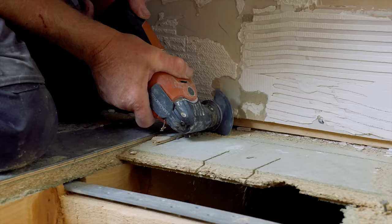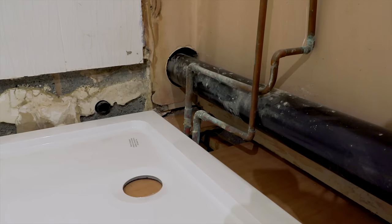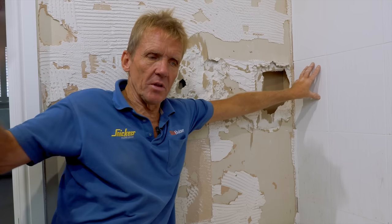I thought I had this worked out, but laying the tray down I realised it's going to be difficult to put the waste in because of the joist running through here. Also, those hot and cold pipes are running straight across exactly where the trap needs to go. So I've got to change the hot and cold supply and move the tray to miss that joist - we mustn't cut through it. It looks like I'll be hacking the tiles off the wall to get the tray back further so we can cut the waste hole on the other side of the joist. You've got to be flexible in this life.